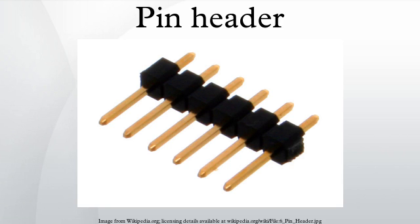Normally, pin headers are through-hole devices, but surface mount technology versions of 1 and 2 row pin headers also exist. In the latter case, the solder sides of the pins are simply bent at a 90 degree angle so as to be soldered to a solder plane. On single row pin headers, the pins are bent alternating to one side or the other; on dual row pin headers, the pins are simply bent outwards. If pin headers are optional, the PTH variant is often chosen for ease of manual assembly.